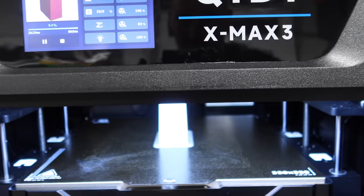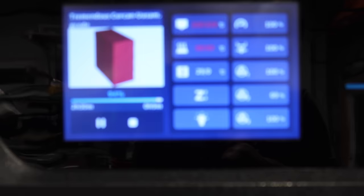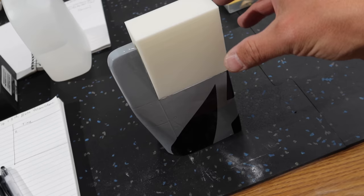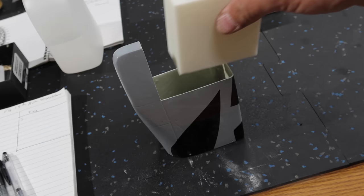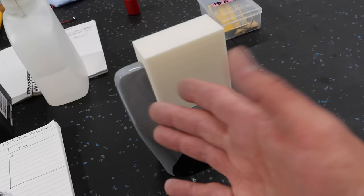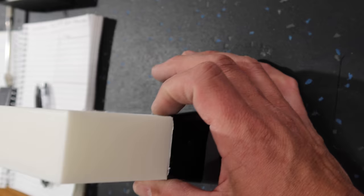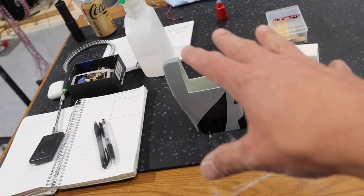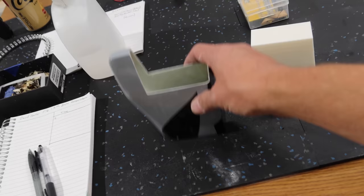Here's a shot of our 3D printed piece so you can better see the angle. We've got nine minutes left on the print. Our 3D piece is done — I did a little bit of sanding to level these surfaces out, and you can see there it worked out beautifully. Our width is pretty much bang on perfect, the overall shape and everything is awesome. This side here sticks out a little bit, so once this is all done it just needs to be squished in when we fiberglass it all on. We still need to round out our edges to make it look like it belongs on the aircraft, and that will continue in upcoming episodes.